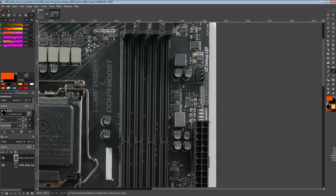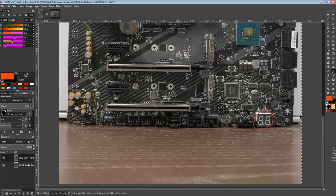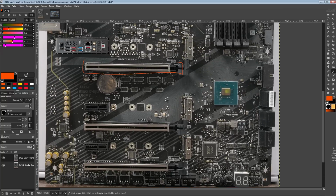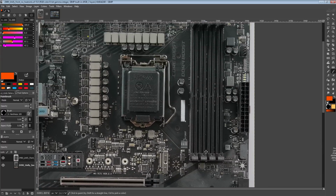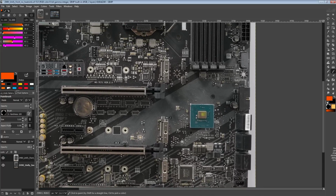Anyway, moving up, we've got troubleshooting LEDs made completely redundant by the postcode, which, incidentally, is in the wrong place. It shouldn't be under the PCIe slots. It'll get covered up by GPUs, which matters especially if you're into benching, though nobody's actually going to seriously bench on one of these. But if you are testing, say, older GPUs, they run into compatibility issues when plugged into the CPU PCIe slots. If you plug them down here, you're not going to see the postcode. So that's rather annoying with Z490. That's actually a problem with Z490 in general, that old GPUs have terrible compatibility at this point. I've not been able to boot Kepler cards on Z490, which is just odd, they're not even that old.